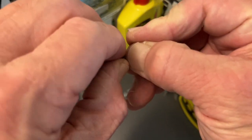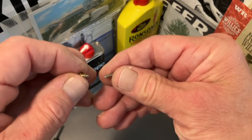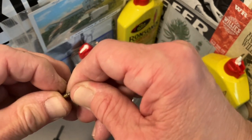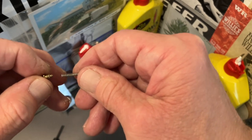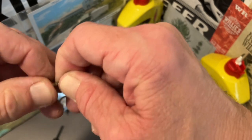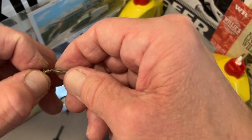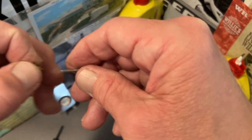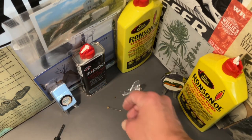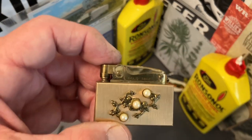Pull this screw off of here, and hope that those will join sufficiently to be able to use it. It doesn't actually have to fit inside there. The main thing is that the proper tension is placed on the flint up against the fire wheel once we have got it all back together.